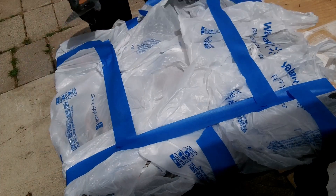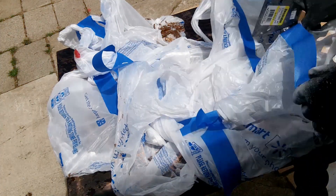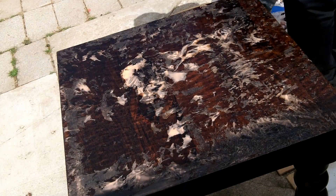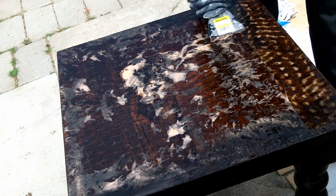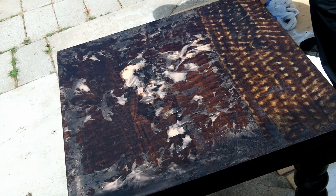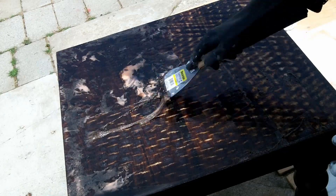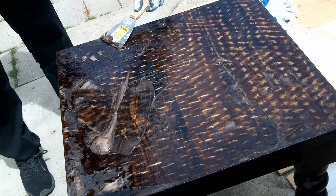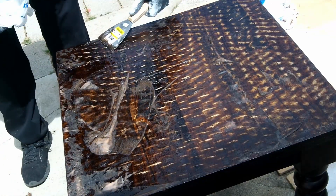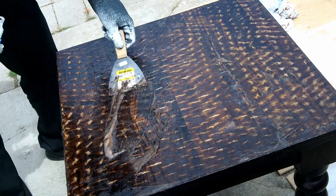As you can see, taking this off gets extremely messy. I have a metal scraper that I'm going to be using on this table, but I would highly recommend that you use a plastic one instead, so you don't put any deep gouges into the piece of furniture that you're stripping. I did not do that for this piece, though even if I had, I would have sanded it down later and likely not noticed any damage done by the metal scraper.